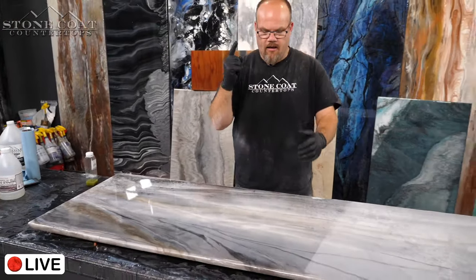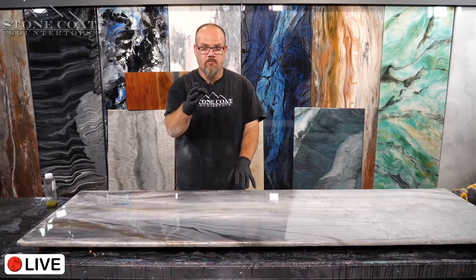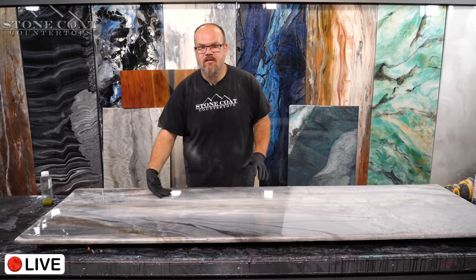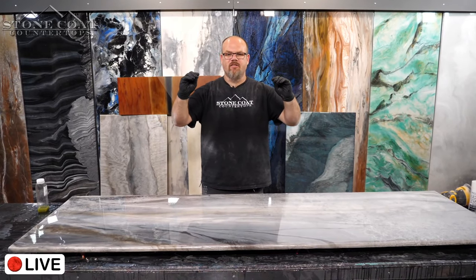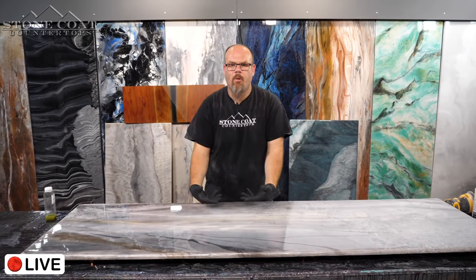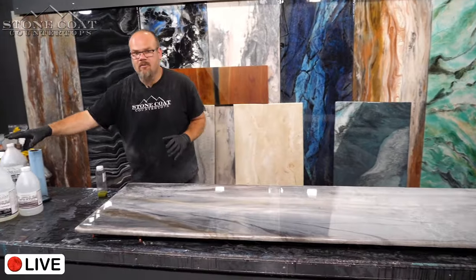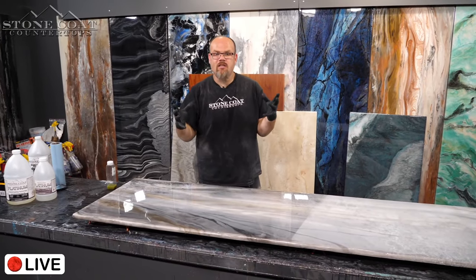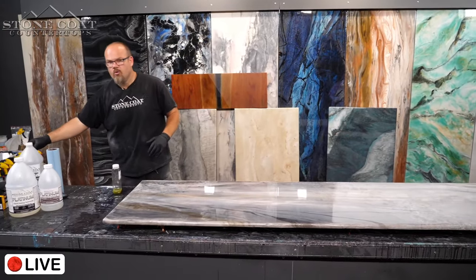What we did yesterday: I did a white undercoat, let that dry, then did the color coat live, and the clear coat live — the whole thing in an hour and a half. We let it tack-free to the touch and then did the clear coat within that recoat window, so it bonded together. What was happening is if the color coat dried too fast, the clear coat couldn't cross-link or bond with it, and we weren't getting great adhesion. Sanding alone wasn't enough.